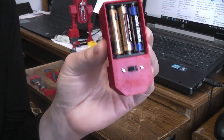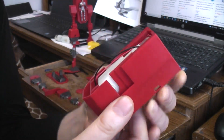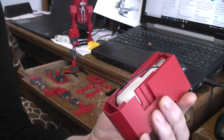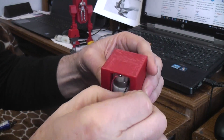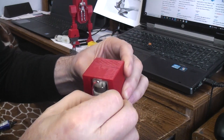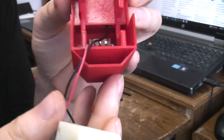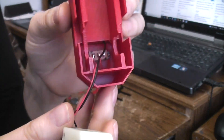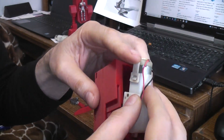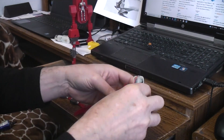I'm using my standard switch which I use in all my projects — 19 millimeters between mounting holes. You should be able to find those and the battery holders on Amazon. I find the motors on Amazon too. The motor itself fits snugly. You bring the wires from the battery holder through those slots, interrupt one of the wires with a switch, then bring the wires up to the motor. When the motor is sitting in this position you'll want it running clockwise if you want the thing to walk forwards.